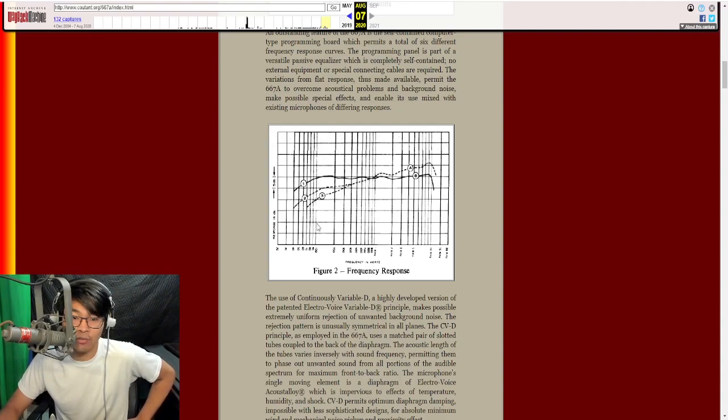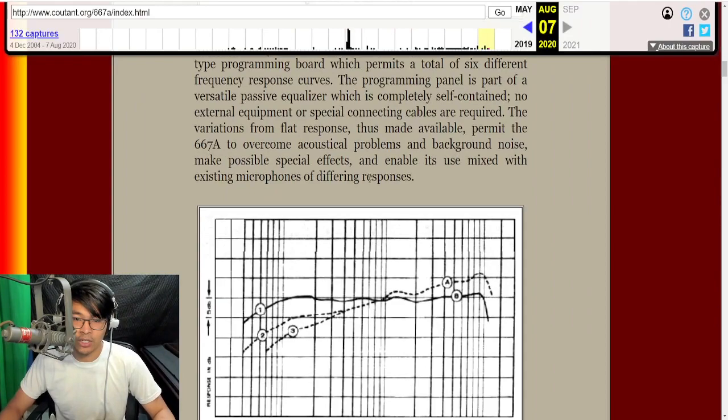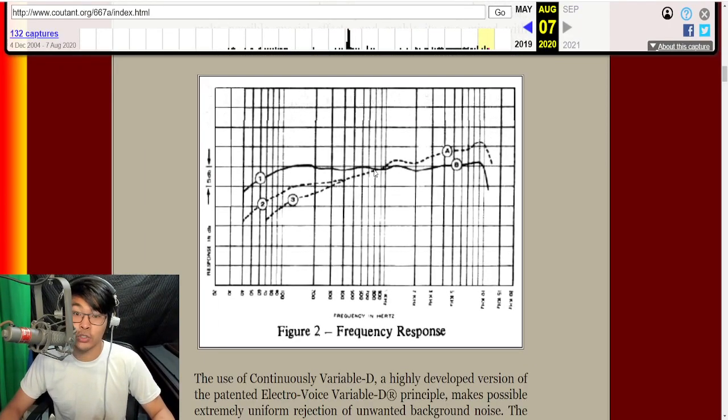It's particularly this graph we want to look at. We have an aggressive roll-off around 500 Hz — you can see where it starts to begin on the graph. At around 500 Hz we start to get a very large roll-off. You have three choices: one is to keep it flat and then the roll-off happens at 100 Hz; number two has a roll-off that starts even more aggressively starting at 500 Hz; and number three is even more aggressive, which can lower down to almost 15 dB or 10 dB just before we hit 100 Hz.